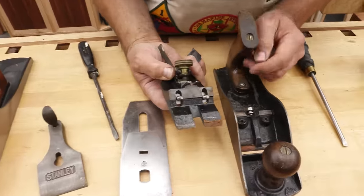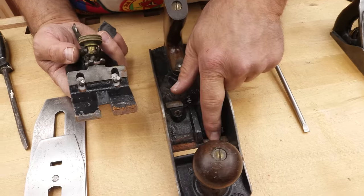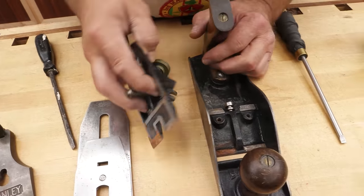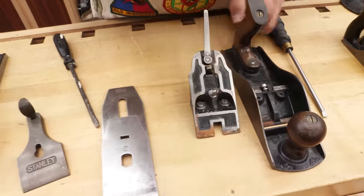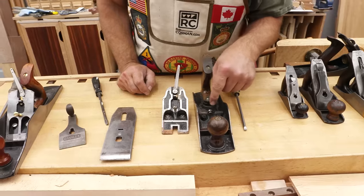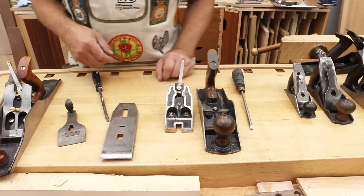And what you have is a little pad here, a little pad there, a pad there, and a pad there, and it corresponds with the pads on this. That's what you have for a mating surface. And knowing how imperfect the grinding is, there's a pretty good chance that only three of those four surfaces are actually going to touch.